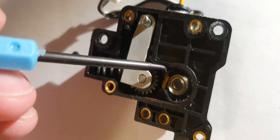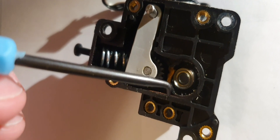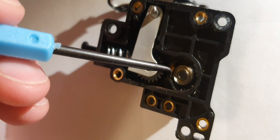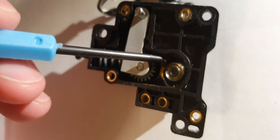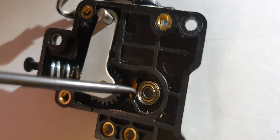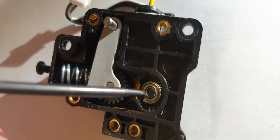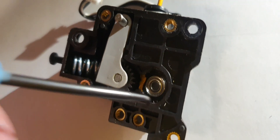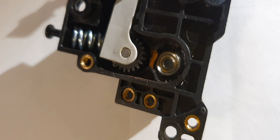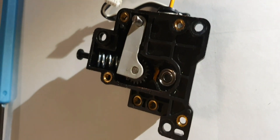If the filament has the slightest angle, or if you pull back filament that has been melted, that filament has a small string on the top. It could perfectly be melted again, but because that string may get pushed to the side, you can get filament leftovers stuck on the side. The main problem is that if this opening had been more like a funnel that can adapt a much bigger piece of filament downwards, then you could avoid these sticking motions — the funnel would redirect the filament into the correct hole.